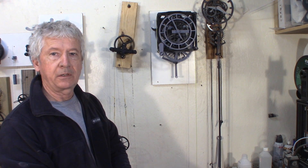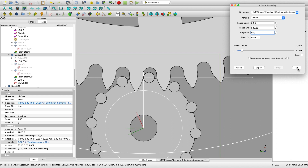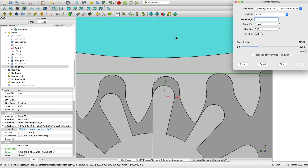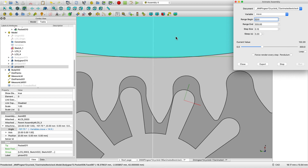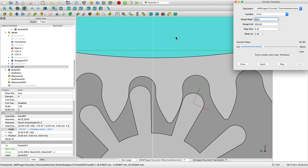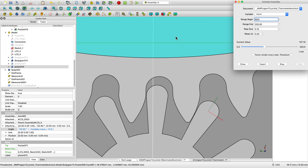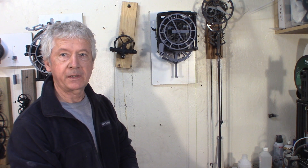What do those gears look like in close-up? This is an animation in FreeCAD — here I'm showing the pin pinion, and then with the same gear, the cycloid pinion. You can see the leaves of the pinion are very narrow with a rounded edge. The point of the gear is what drives the pinion on the leaves. The profile for those gears can be found in a document — I'm putting the link below. Technically the profile is the English standard, and at the end of that document there's also a link to another article about involute gears in clockwork.